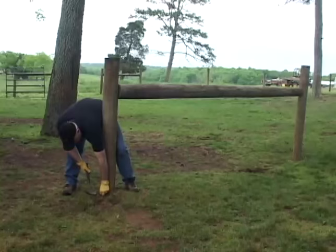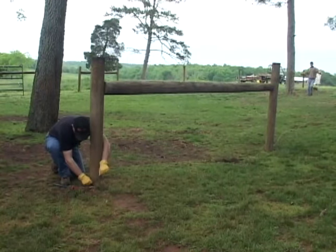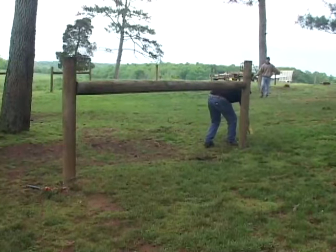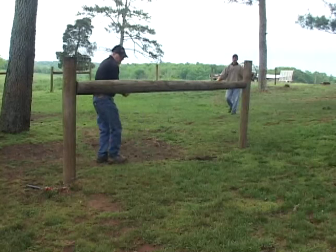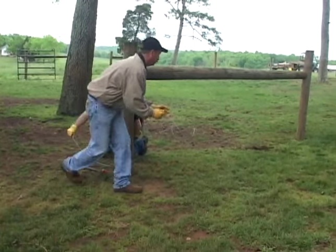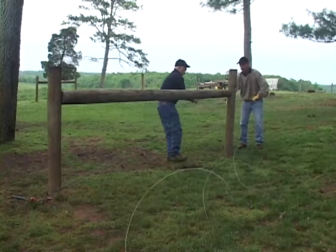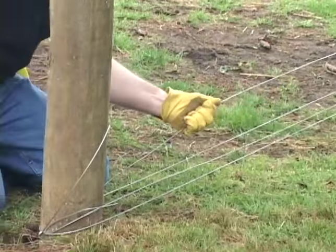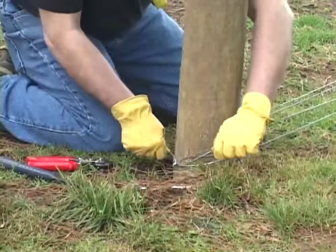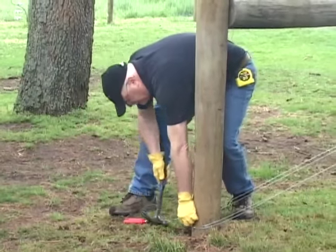Place a fence staple at the bottom of the corner post, just above the ground, making sure that the staple's ends run in a vertical fashion. With at least 50 feet of 12 and a half gauge high tensile wire, thread one end through the staple. This wire will form what is known as a twitch wire. Its purpose is to tension the brace and provide strength to overcome and balance the pressure of the fence wires pulling on it. Run the twitch wire around the brace post just above the protruding end of the pin. Repeat this process once more so that both ends of the wire run through the staple, exiting on opposite sides. Pull on the twitch wire with Gallagher fence pliers to remove the slack, then fold each end over the staple and drive a staple over each pair of wires, fastening them securely.